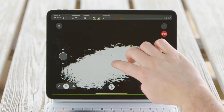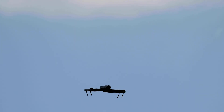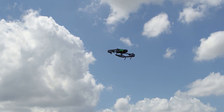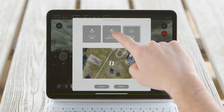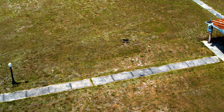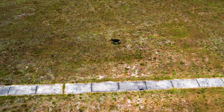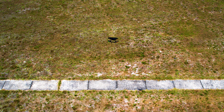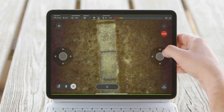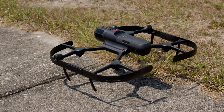To close out this first flight, we are going to be testing the Return to Home function. This is a very simple process and can be completed at any time during the flight. Although you can reach the Return to Home option from any of the three flight screens, we are going to switch to the Live View. Select the Return to Home icon in the bottom right of the screen. You will be presented with three options depending on your need. For today, we are going to select the Return to Launch Point. Once you have selected your landing position, you must confirm the command. The drone will immediately begin to return to the user-selected landing position. If for any reason you need to cancel the command, a large X button will appear at the bottom center of the screen. Once in the landing location, the drone will begin descending and display the downward camera and bring the virtual sticks up on the screen, allowing you to make corrections to the drone's position as it is descending.